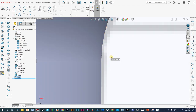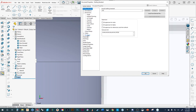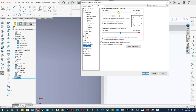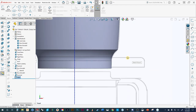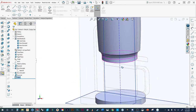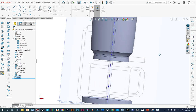The radius looks a little bit jagged — I think that's because I forgot to do one of my settings. So we'll go into Document Properties > Model Display > Image Quality, and just crank that up as high as we can go. Now you can see how that edge is all smooth — that's more just to visually help you know whether you have it done right. What we have next is the handle part, and it's all going to be one shape. Let's build that and complete it before doing anything else.